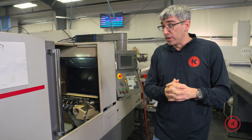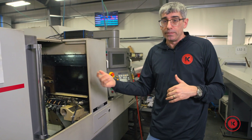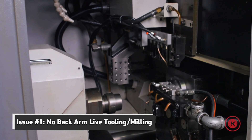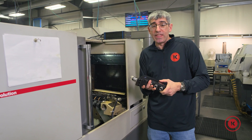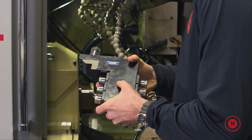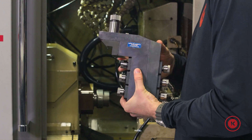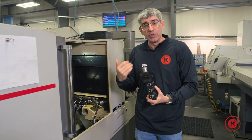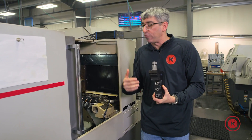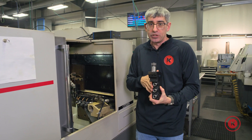A couple of cons with it. The backside tool, or the B arm, doesn't move — static, no milling or live tooling on the back. You do have the option to add some live capability with some driven tools off your gang, which will give you front and backside work. These accessories are expensive and we don't use them very often. We have them if we need them, but if we have something that needs that level of complexity, we're probably going to run it on our L32 machine.